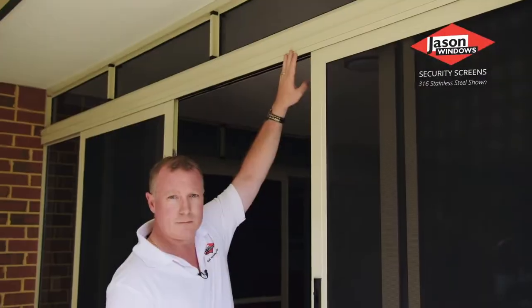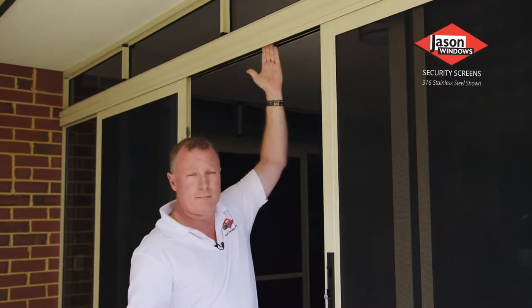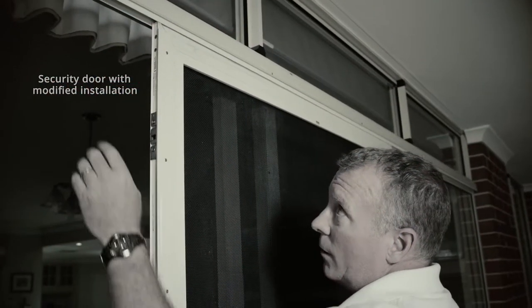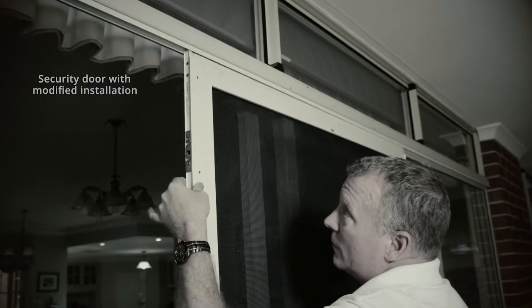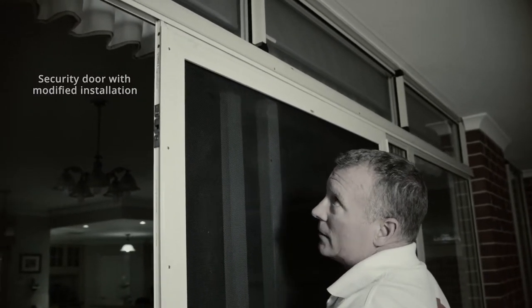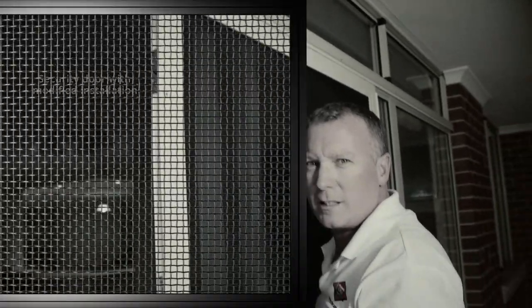With a head channel, centre running track keeps the door perfectly positioned and centred on that head track so that you don't get any undue wear. You'll notice that without a specific centred running track, the door has a lot of play. And over time, it's started to wear all the powder coat off the door and makes the door have a harsh, grinding, sliding sound.